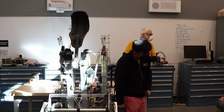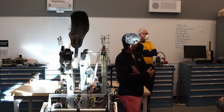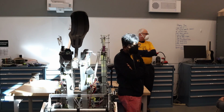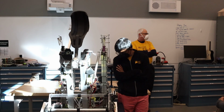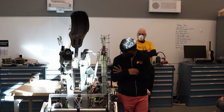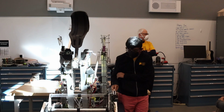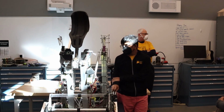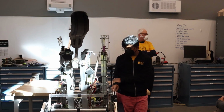No, but do you understand what I meant by normally open and normally closed? Yeah. Then does the audience know that? So that if the actuator gets to its limit, do you want it to activate the switch or deactivate the switch? If you have it deactivate the switch, that means that if the switch ever fails, the operation won't work, which is actually better than having a limit switch that activates and there's a broken wire and it never gets activated, and then things break.